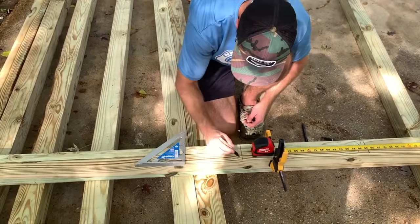Basically, you wanna put enough adhesive so that the acrylic panel is going to contact the overhang and then permanently be adhered to it, but you don't wanna put too much to the point where when you push the acrylic panel against the overhang, you're gonna have a bunch of the adhesive squeeze out that you're gonna have to wipe off later. So apply enough, but don't put too much.